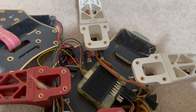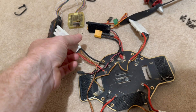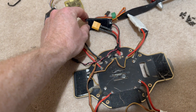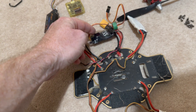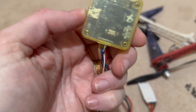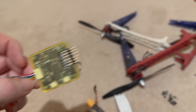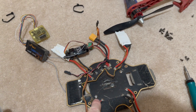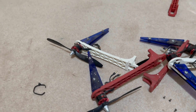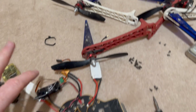So let's continue stripping. This is the main plate for an old DJI 450. You add these 30-amp optos, they go onto this plate where all these points are common. And then you go into something like this BEC here to drive 5 amps because these were opto. This is a CC3D board and looking at the symbol there, it looks like that was an original open pilot one, which is quite interesting. We don't need these ESCs, so I'm going to desolder all of these, get rid of the BEC. I think I might just take all these off and clean them up because they're absolutely filthy.